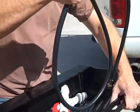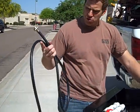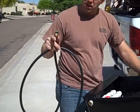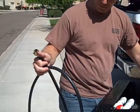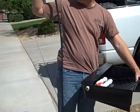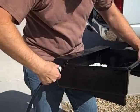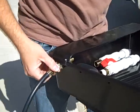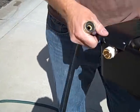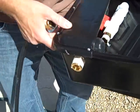This is basically a hose that you use for a washer machine. The reason I use that is because this is pipe thread and not hose thread. It's a six-foot length and it just threads onto here. I'm not going to thread it on right now because I don't want to mess up the Teflon tape I put here — that's to prevent it from leaking.